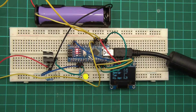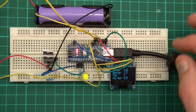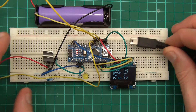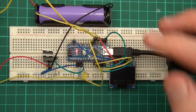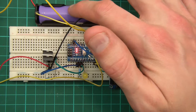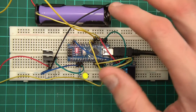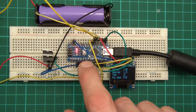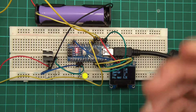For a few weeks I've had a problem: the Arduino can be powered through this cell here, so even if I pull the main power out, the Arduino is still on — the LED and screen are still on. What's happening is this cell is powering it because we've got wires here meant to test the voltage of the cell, and they're going into the analog pins, allowing the chip to use them to provide voltage and power the Arduino.